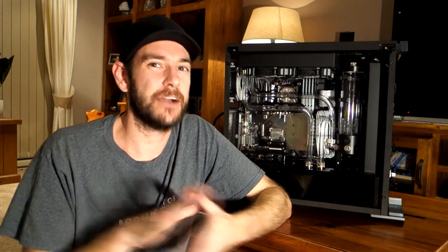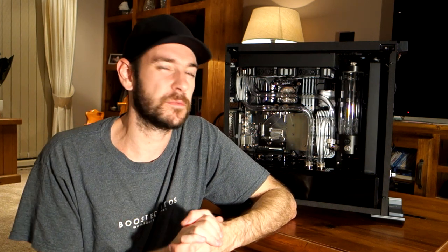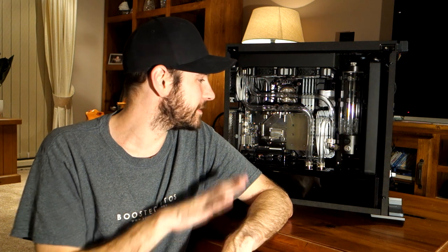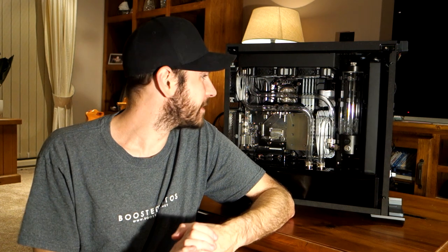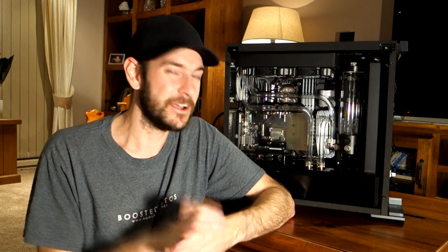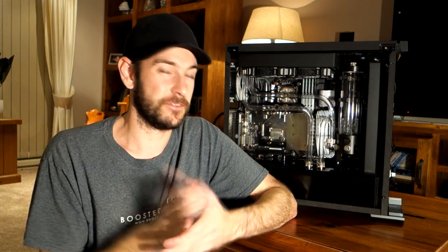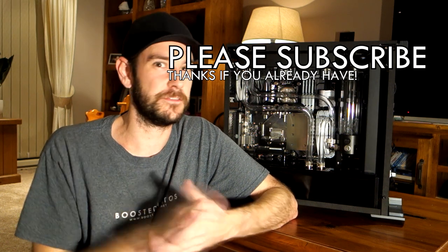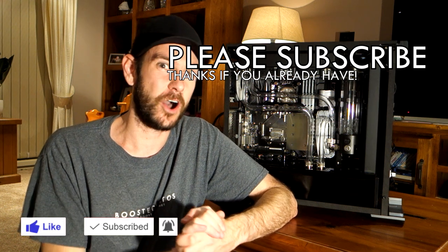That's my rundown on how to do hard lines with PETG tubing. The methods are a little bit different with other types of tubing, so make sure you do your research and don't just follow these instructions without checking. A lot of the basic principles around how the fittings work and how to handle the tubing do apply across the board. As you can see beside me, we're pretty much done now. All we need is final leak testing, finishing some cable management, and hoping we don't have any DOA parts. The next video I'll show you how to prepare and start doing leak testing, including a little tip that lets you do a leak test without adding any water to the computer - minimizing the risk of leaks. Then we'll move on to cable management and filling up the computer. Thank you for watching - hit that like button, subscribe, and hit the notification button. I'll see you in the next video.